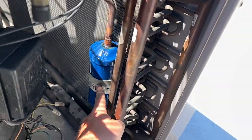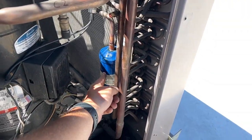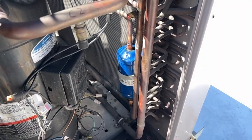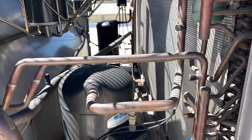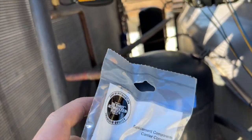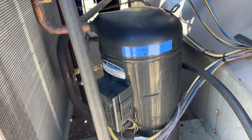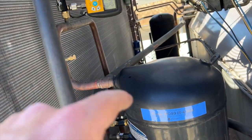I put the pipe strap back on enough to keep it from vibrating and rubbing up on stuff. It's very important you put those back on — otherwise the whole pipe will vibrate, could rub up on something, and create a hole. This is just my wire I was using to hold up the pipe while brazing, so I'm taking that off. Letting the pressure out now, then we'll get the vacuum started. We've actually got our pressure switch early so we're going to install that — we're at 840 microns now; it's taking forever because it's a big unit.